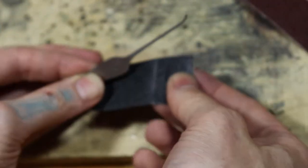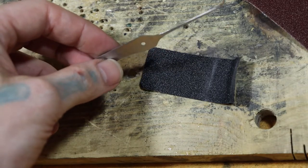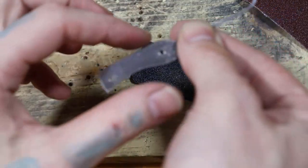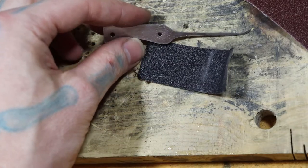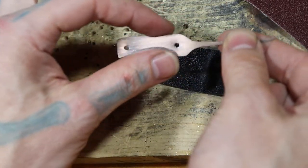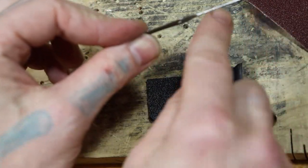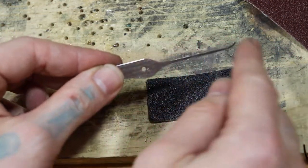And you do the 100 grit, do 220, maybe even take it to 400 next. You don't have to go any further than that, but yeah, do all the edges all the way around. And 400 will be good enough, because by the time you glue this in and everything, the rest of the polishing that you're going to do on the pick and the sanding later will get the rest of this nicely polished up. But yes, you want to get this part more than anything, where the pick is, nice and smooth now.